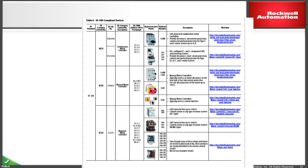This product portfolio brings together the type of product with a picture of it, and importantly, its UL file number and the UL standard it's compliant to. The file number is quite important as it's used in customer technical data files to prove the product selected is suitable for the right application. Note that some products are UL listed and others are UL recognised, meaning they must be used in conjunction with a UL listed product to be compliant.